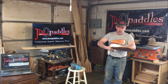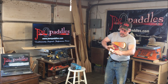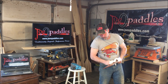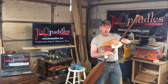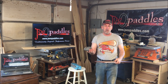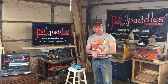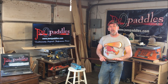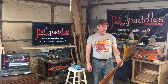And that's about all there is to it. That is done for the first coat. Now tomorrow, in between coats, what I'll do is take a piece of ultra-fine steel wool and use that to rub down the entire paddle. What that's going to do is just rough up the surface slightly so the next coat of oil can penetrate more easily. So rub it down with steel wool between coats, take another clean cotton cloth to wipe down the paddle after rubbing, and then you're ready to reapply the next coat of oil. Wait 20 minutes, then rub it down.